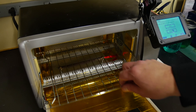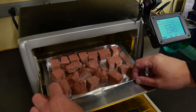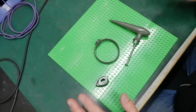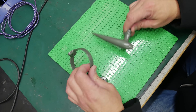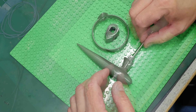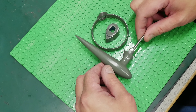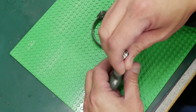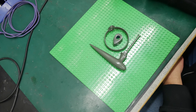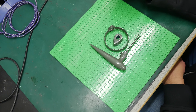It's time to take another stab at the silicone mold, and we're going to need a bit more clay for what I have in mind. I'm going to heat this up in the oven, 60 degrees for 30 minutes. My thought process this time is a little different. First, I'm going to mold all three pieces in one mold. I'm also going to pour this piece in a sideways orientation rather than upright, so the mold parting line will be in this plane. We need to pay more attention to venting because that metal is going to go in there and freeze up pretty quickly, so air won't have a chance to work itself out.